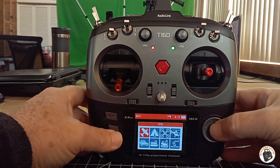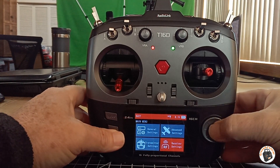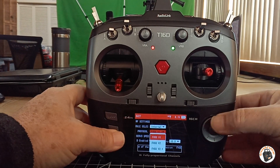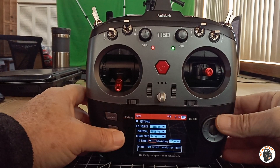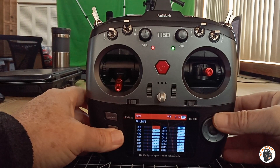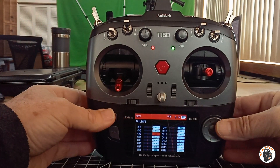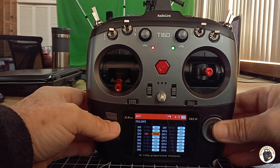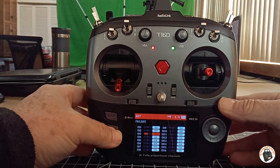Let's go back to advanced settings — make sure we've got the proper type, which is airplane. That looks good. Now in receiver RF settings, internal module — I want it for FHSS V1 protocol, servo speed 14 milliseconds, no sub ID needed. I'm going to set my failsafe: aileron on channel 1 at zero, elevator at zero for neutral position, and channel 3 which is my throttle at minus 100, so it will shut down the motor if I lose contact.